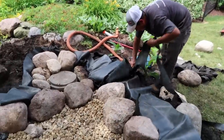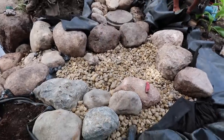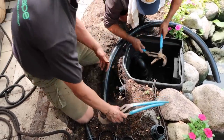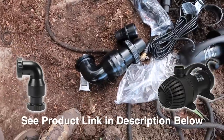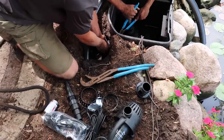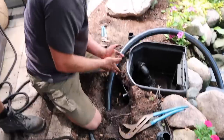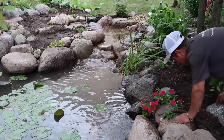You can see Juan cutting all the excess liner off the back side of the bog. Here is the constructed wetland filter — it is rocked in. While he's working on that, Matt and Corey are over here working on plumbing in the new pump. They put a two-inch MPT on right there coming out of the back of the bulkhead on the close side of the skimmer. They're installing the new check valve along with the new AquaSurge 2000 pump that will feed the two-inch pipe. If you have any questions on the installation of a skimmer there should be a link in the description below. Juan hosing off the sidewalk means our bog filter is complete.